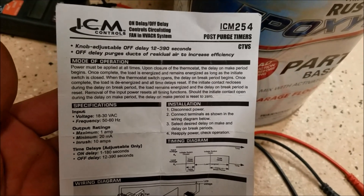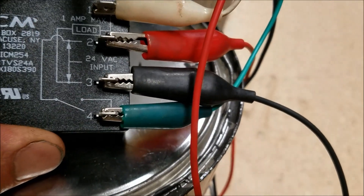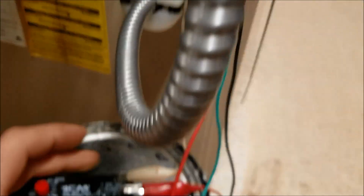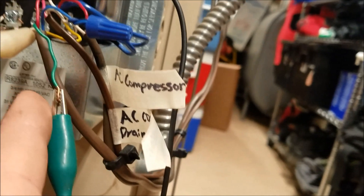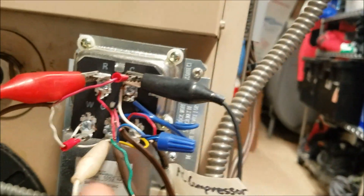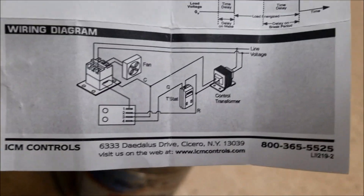Here's a look at the instructions and the wiring diagram — pause if you want to take a closer look. Basically, take your green wire coming from the thermostat and hook it to terminal number four. Then take a wire from your red constant 24-volt side and run that to terminal number two, the 24-volt AC input. Take the blue always-common wire and run that to terminal number three. Then take a wire from terminal number one and run it over to the green terminal on your block — that's normally where the thermostat's 24-volt green signal goes to trigger the fan solenoid, which clicks on and sends 120 volts to your fan. Very simple.